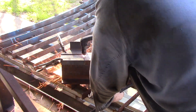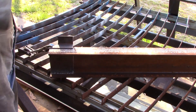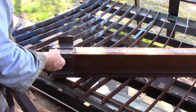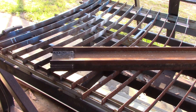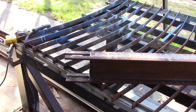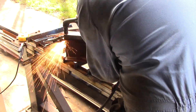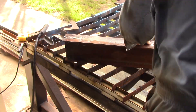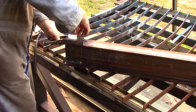This is the main I-beam, part 001. It forms the backbone of the splitter, and at the moment I'm plasma cutting out the first piece of the centre section on one end so that I can fit the horn that we just saw previously into it and weld it in place. I also plasma cut a section from the other end, which is a slightly different size because it's got to take the thinner end plates. I have three end plates — I weld one in the centre and one on each side — and some face plates on that.